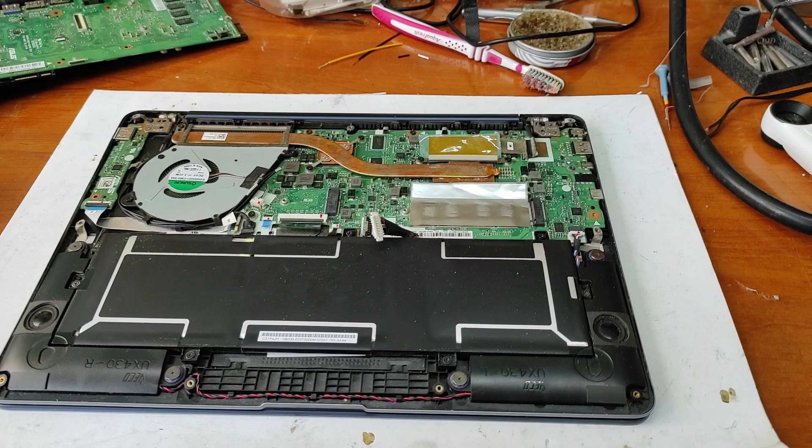What I wanted to be a simple task turned out to be a very difficult task, because this laptop doesn't want to power on anymore and remains in suspend. I took all the devices out - SSD, Wi-Fi card, and all the connectors. I took the display out to check if this laptop would power on again, but it doesn't want to power on. I found the schematic and checked it along with all the parts.